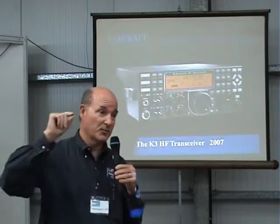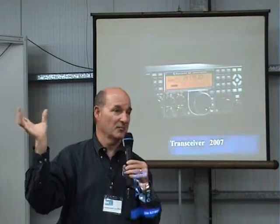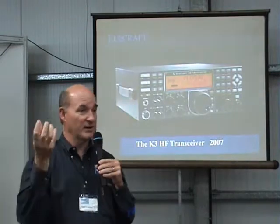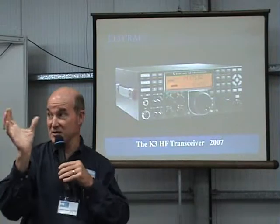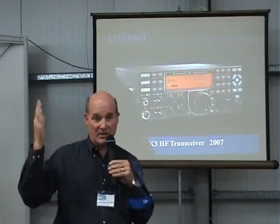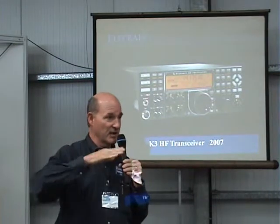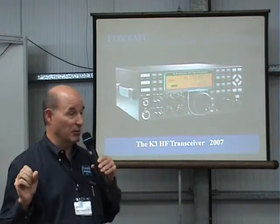But we were also pushing the crystal filters to their mechanical limits. It's like when you take a resonant anything, a bell, and you run a high enough signal into it, it's going to distort at some point. Below that, it's a great filter. Above that, it starts adding its own intermodulation distortion. Crystal filters are no different. The way they cut the crystal and how they manufacture it, though, has a wide variability, even in the ones being made commercially that we were receiving.